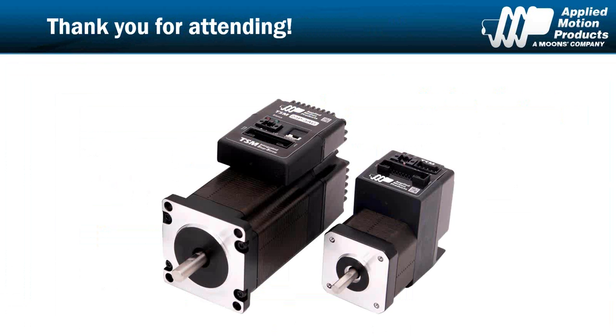I have a question about Ethernet IP. Have we tried it with a Rockwell PLC through Ethernet IP? Yes, we have application notes on our website for the Logix 5000 software, and we have add-on instructions available for Logix 5000. So if you want to use our StepSERVO integrated motors, or actually any of our motor drive products with Ethernet IP, we have support for CompactLogix and ControlLogix through our add-on instructions.